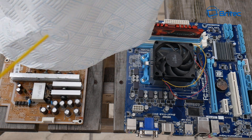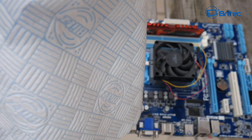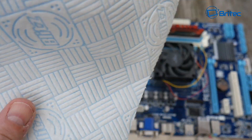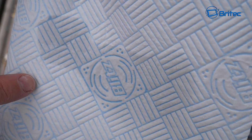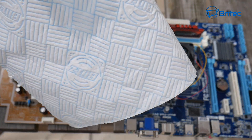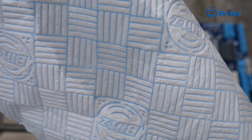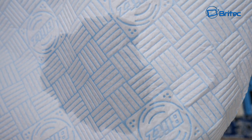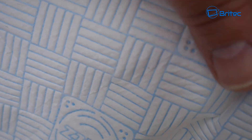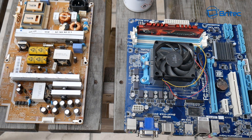Without even wiping it with a cloth, the board looks pretty clean. Let me show you by spraying some onto this cloth — you can see it's pretty dry already, hardly any wetness; it may look wet but it is dry to the touch. Now with the isopropanol, as you can see, it saturates the cloth quite a lot — so there's a big difference in drying time. But both are harmless to electrical components and both do a pretty good job.